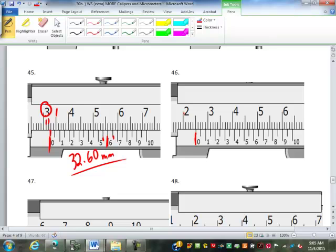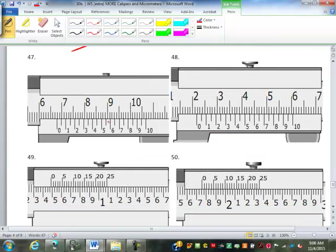So here's the 0. This is 25. So that's past the 25 point. What lines up here? So it's either this one or this one, right? I'd say the 1. I'm saying this one right here. That's not the one. That's actually the 1.5. That's 25.15 millimeters. See, this was at the 6. That's actually 6.0. That's 60. This is 10, 15, 20, 25, 30, 35, 40, 45, 50. That's what that reads. I know, it takes a little more thought with these, doesn't it?